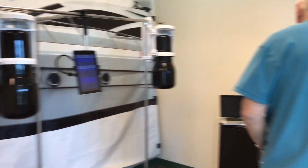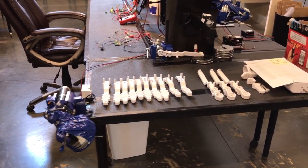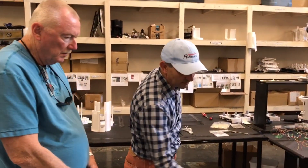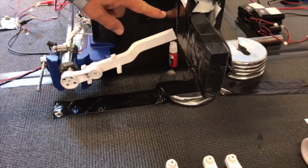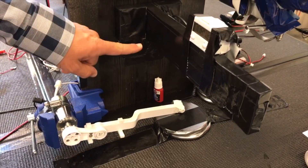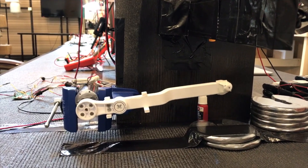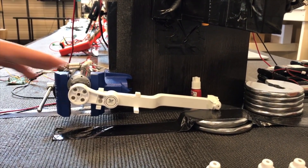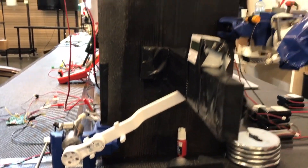Let me show you the lamp — right now it's for marketing purposes. We already chose our motors. Motors break because of two issues: one is load while turning, the other braking mechanism — which is even worse — is when the motors stop abruptly. In order to ensure a very reliable product, we tested each and every motor type, both in this station and that station, and made sure we can do a few tens of thousands of cycles with each motor type before choosing it.